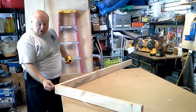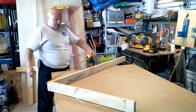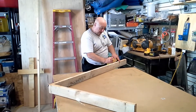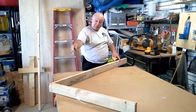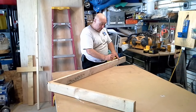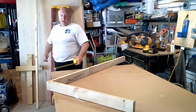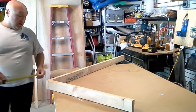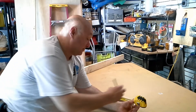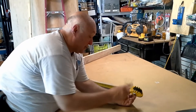Start on your point — the outside of your point — hook your tape measure, and this way we're going to go four feet here. Come over here and measure four feet. Now make sure you're on the same plane as where you hook the tape measure; you're on the outside here — you don't want to mark it on the inside. So you're going to go four feet here, and then on this side we're going to go three feet right here. Mark three feet right there on the outside.